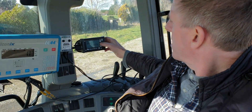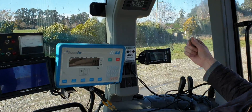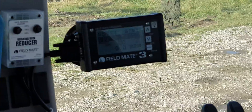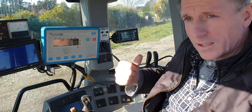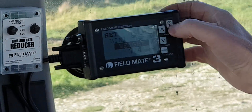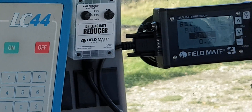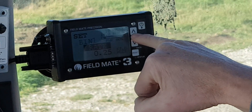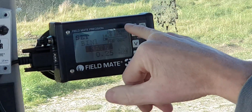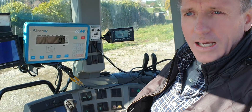Calibration is super simple. If we were to calibrate a bin, just come into here to set bin one, and straight away it's waiting for you to calibrate. You can walk down to the bin, push the calibration switch on the drill — that releases material from the bin. Then you shoot up here with your weight, enter the weight you got from that bin, drop down, enter your drilling rate in kg per hectare. We've got a bar graph to show your drilling rate at a set speed — so at 10 km/h it tells you the motor is running at 14 RPM.